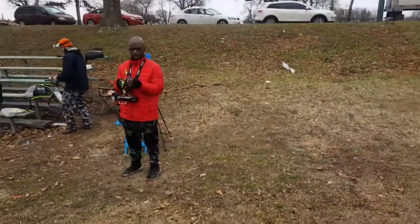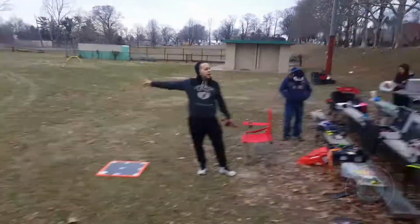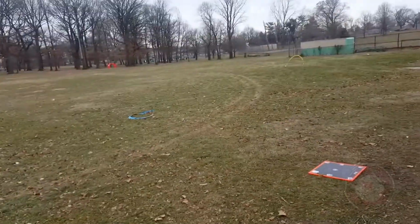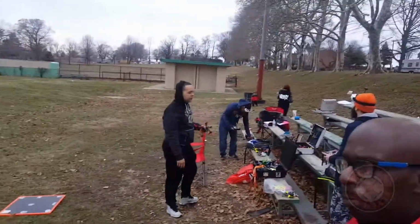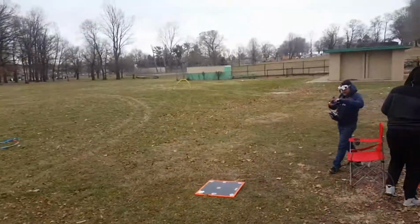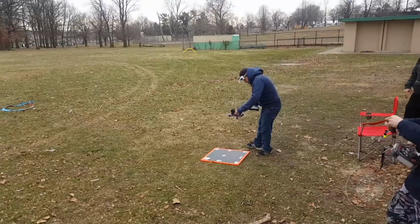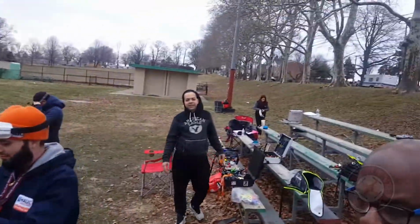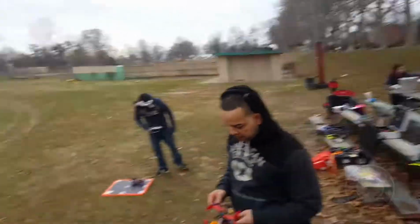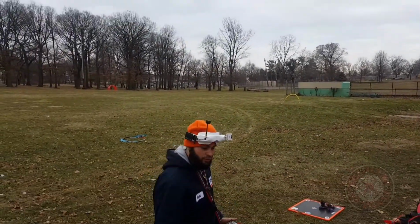What I'm gonna do, I think I'm gonna take the motors off it, because the motors are real powerful. When I use a regular 2S battery and some regular props, it sucks all the juice from the receiver. Whenever I throttle up, my receiver light goes off. Oh damn, that's crazy. When I use a big battery like this, that's the only time it doesn't happen. I was wondering, because this receiver runs off 3.3 volts, if I go to a 5-volt pad instead, like use FrSky instead of this DSMX. Okay. I'm gonna put the 3S so you can see the 3S on this.